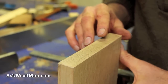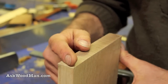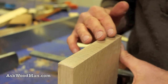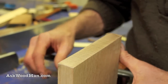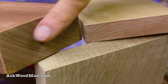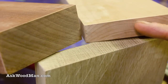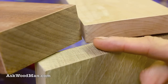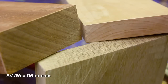One of the reasons it's so important to be able to cut end grain cleanly with a plane versus trying to sand it is that the plane doesn't generate very much heat. Often you'd have to sand this so aggressively with a power sander to get it smooth that you can actually make the end of the board crack. It's so important as woodworkers to be able to quickly cut end grain on even the hardest woods — the hard maple, the white oak, and that piece of mahogany which isn't nearly as hard as these two.